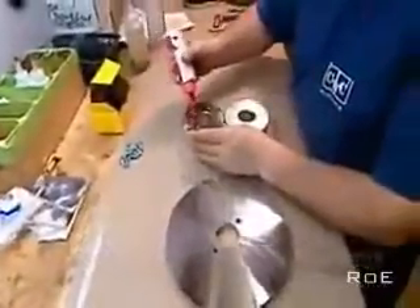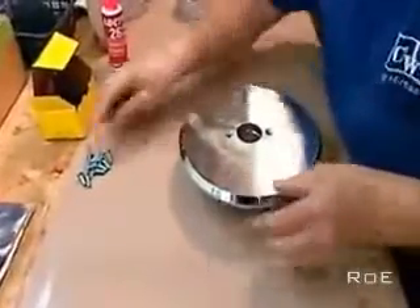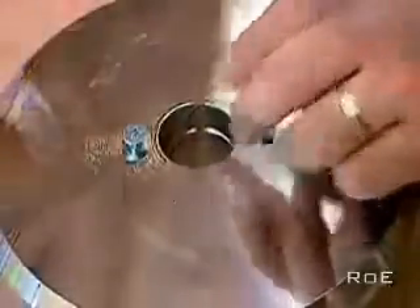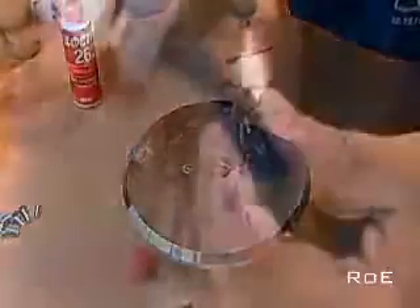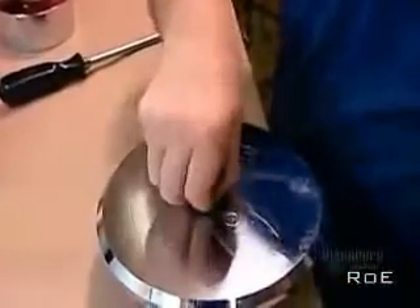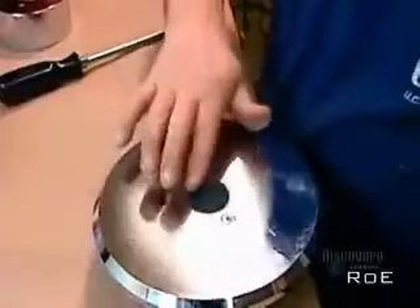Next, they cut a smaller and thicker round piece of iron called the core. A reamer bores a large hole through it. They apply super high strength epoxy glue to the core and to the back plate — the plate with the smaller hole. They glue and screw the pieces together because the bond has to be strong enough to withstand intense magnetic pull. They glue a foam filter in the hole to ensure the vibrating cone doesn't draw in dust and cause internal damage.